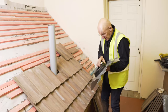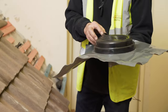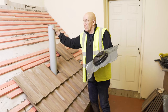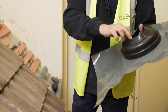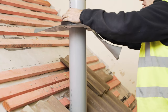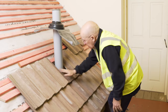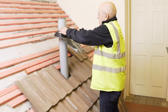Have a look around the outside that you've just cut. Make sure there are no nicks going downward — if you get a slight tear going downwards when you strip it over and put it over the pipe, it will stretch it and could very easily split. Make sure the tile it's going down on is dry and clean. If it's wet, it won't stick.